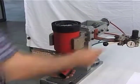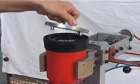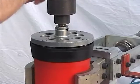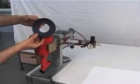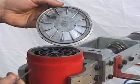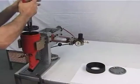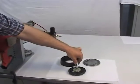Fasten the riveting tool in a vise and disassemble the cover, figure 84, using a special wrench supplied on request. Remove the bottom, figure 83. Use suitable pliers to remove the group consisting of pneumatic piston, stem and dampener, figure 79, 77 and 76.